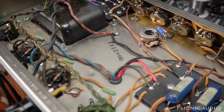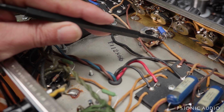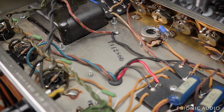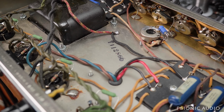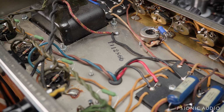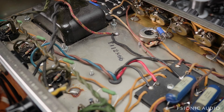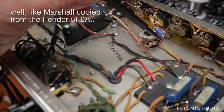joints. And of course, here I've added one more capacitor from the wiper of the bias pot to the shell, and that just gets rid of the last hum in the amp. It's just a little trick. Actually, Fender incorporated that same trick in the '70s amps, where they would have two capacitors in the bias supply, they used two 70 microfarads. I've got 47 and 22 here. Still does the same thing. You can pretty much do it with two 10s like Marshall did. But the series resistance from here to here decouples these stages.